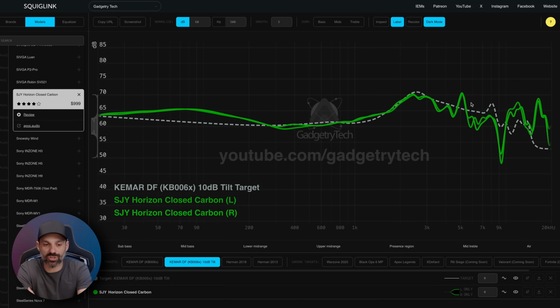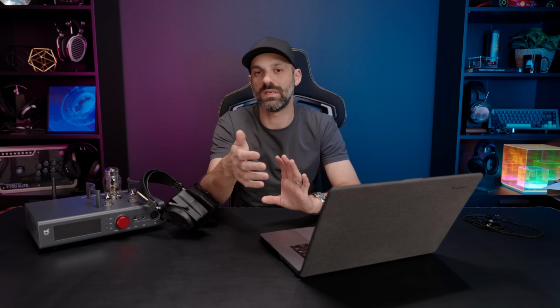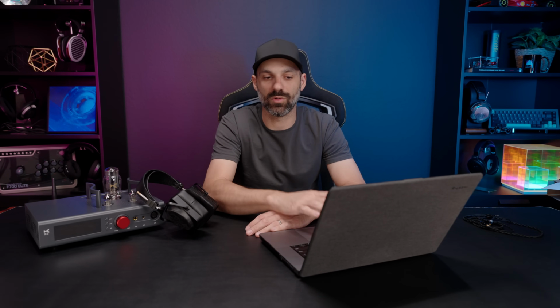This doesn't really show insane treble to some people. This peak is definitely there. It's a little bit snappy at 5 kilohertz, and on my ear it does come in sooner than what I hear on the 6000 hertz peak on the Sennheiser HD800S, but there are no huge dips around it. So it's not like this random spike just comes out of nowhere. It's still somewhat tied well to the adjacent harmonics, which is really important for instrument accuracy.